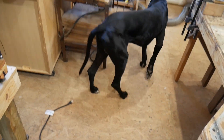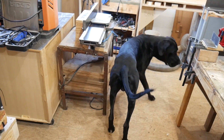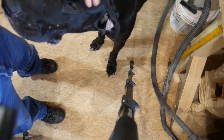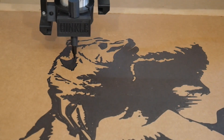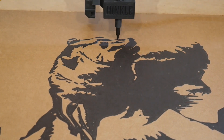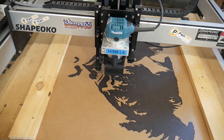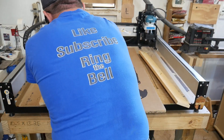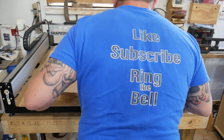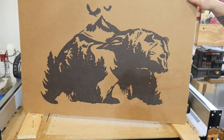I have an idea with this thing — there's old Mr. Atlas for you. I think I'm going to make some coloring books with this for my grandchildren. How much fun would that be for them to have unique coloring books that no one else has? As for how I programmed the machine: I'm using Carbide Create software. I'm lying to the machine, telling it I'm using a 60-degree V-bit and an eighth-inch end mill. I'm running the machine at 100 inches per minute and using 20 thousandths of an inch max depth.